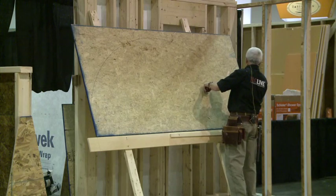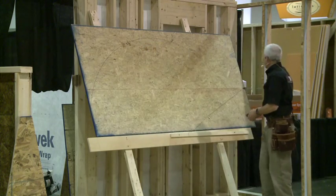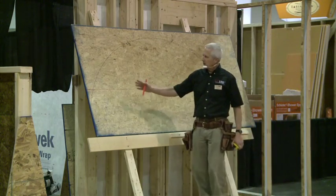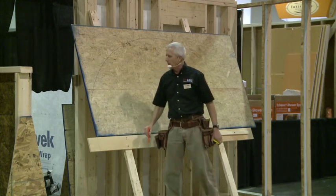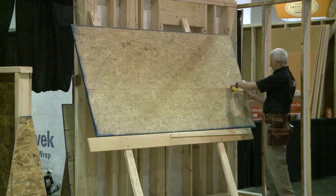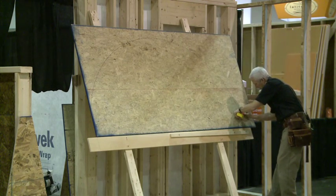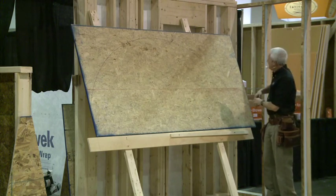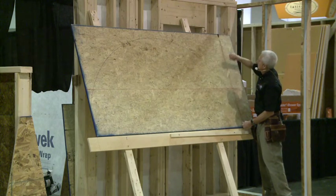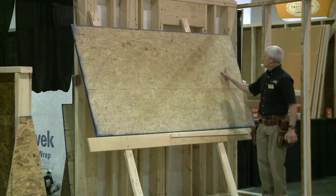This is one rib that I'm making — this is one pattern that I'm snapping here. So that's our segment. I positioned it so I have about four inches here; that's where the wall will sit. I want to do the same thing over here — measure about four inches over. See what I have left? About eight and five-eighths. Square that off. So that's the segment, that's my rib right here — that's my pattern.